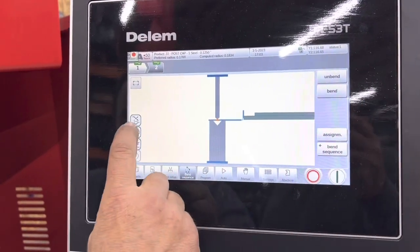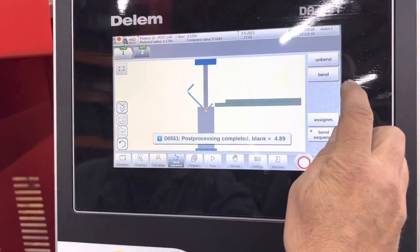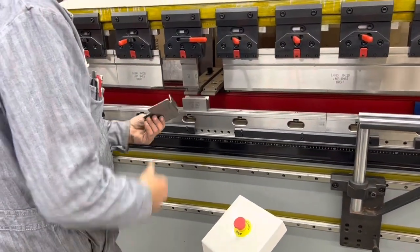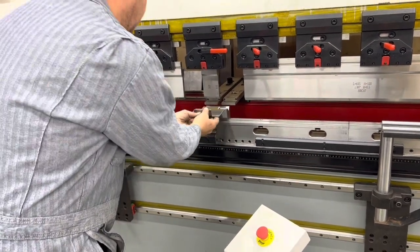Bend 2 is flipped inwards — I'm going to flip it outwards, hit bend. Looks good: 4.89. If I could have centered it a little better. Oh man, just a fuzz open, which is fine by me for our test piece.